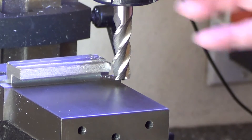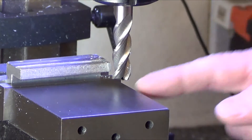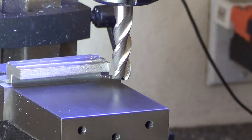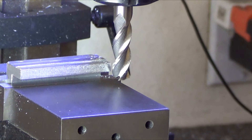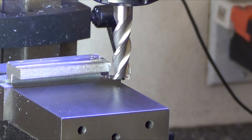Suppose you're going the other way — that's called climb milling. Now, if your table is pushed one way and it's capable of coming back, when you try to do a deep cut with climb milling, the second the cutter hits the surface it pulls the table into the cutter, making a deeper cut. What winds up happening — and I've done it — is the part comes flying out of the vise, your motor stalls, your cutter gets ruined. You just rip things up.